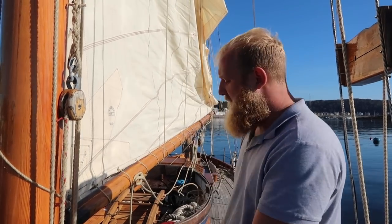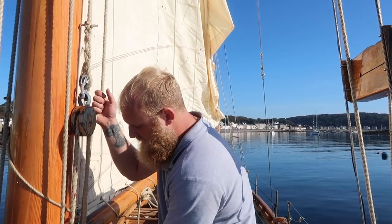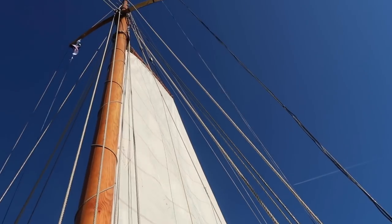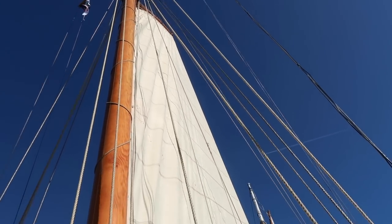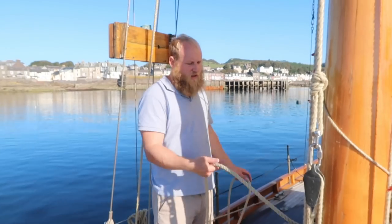We're back on this side again to finish with the peak. This is why I want to switch to the same system we have on the mizzen — this slows things down quite a bit, and if you're in high seas trying to sort this rig out you only want it on one side. We'll finish this off: keep pulling the peak up until it goes nice and tight and we get a crease from the end of the gaff down to the foot. You can see the crease starts up here; we can sweat it a bit. On this one the mast isn't going to bend because it's stayed.